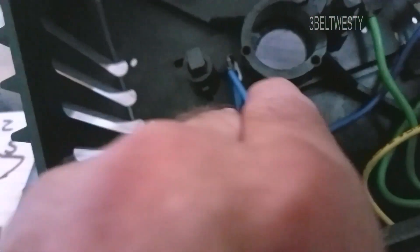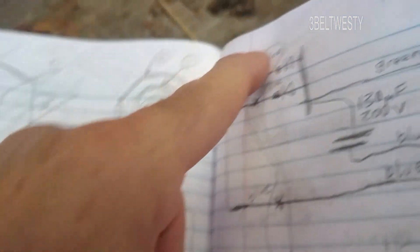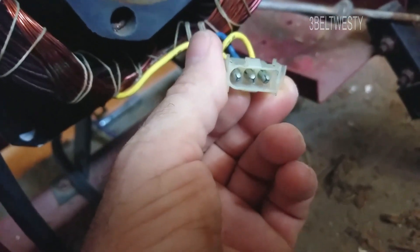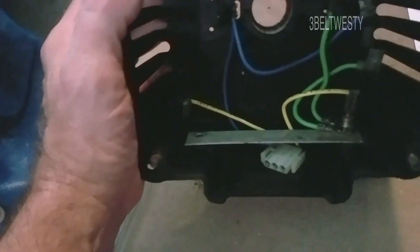On here you've got two blue wires — one hooks up to the connector, this little amoeba-shaped piece. What I'm going to do is undo the clips and have the wires come out through here, leaving the connector in place so I can put it back when I'm done. Then I'll hook an external half-bridge outside and extend the wires out.